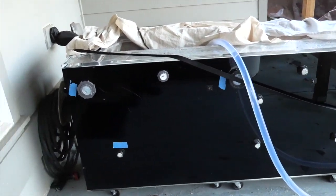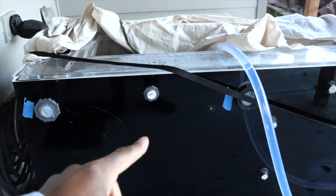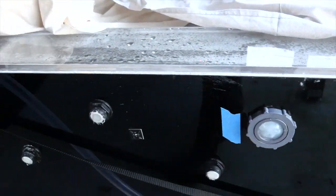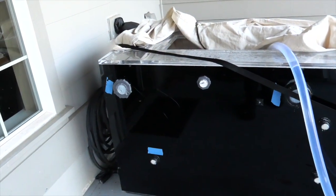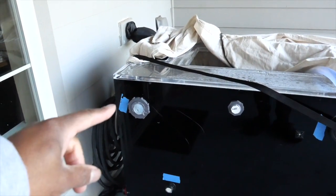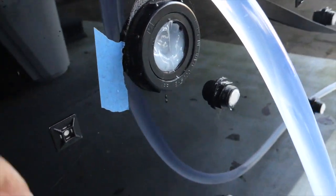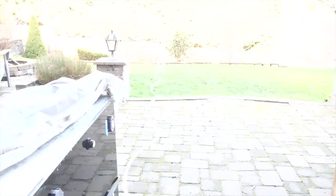Stage one is pretty much complete. I replaced the bulkhead there, though I could not find a cap that size so I siliconed the bulkhead — it has not leaked. I drilled the hole there and replaced those bulkheads. I filled in with silicone and they have not leaked — not the way I would have preferred, but finding caps for 2.75-inch holes is very difficult as it's a special size. I also drilled one hole bigger and there's a little water dripping, so I'm opening it up and re-siliconing. I'm now draining all 300 gallons after it passed a one-week water test.